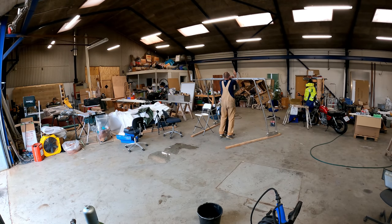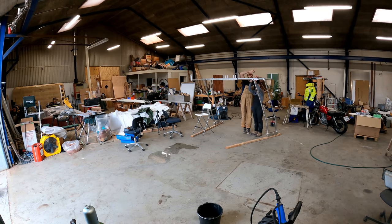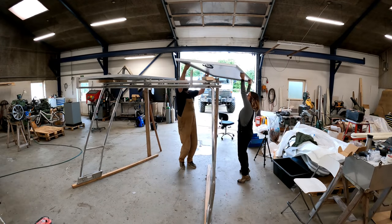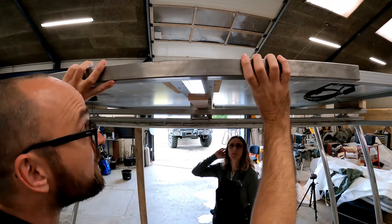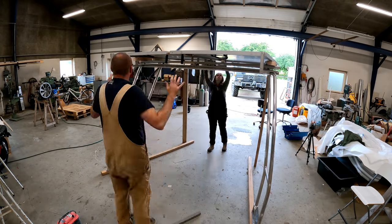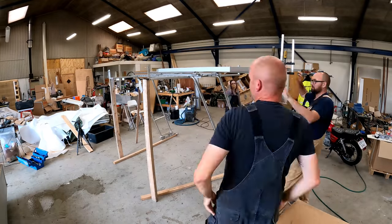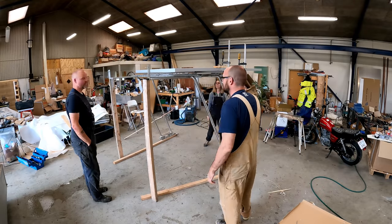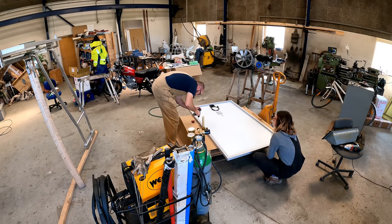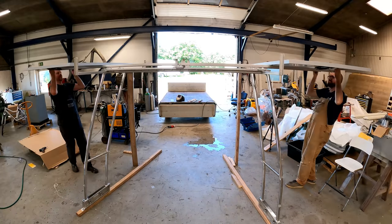At the workshop, Ava and I started by tightening the 86 nuts and bolts that secure the aluminum track for the sliding solar panels to the arch. We have thick UV-resistant plastic separating the aluminum from the stainless, and plastic washers separating the fasteners from the track. The solar panels are big and bulky but we managed to get the top two panels in place and lined them up perfectly using a bit of square tubing. The two panels were secured to each other with clamps and lined up on the arch before drilling any holes. The cement boat crew showed up just in time to help with the bottom panels — the ones that are going to slide. There were a few minor adjustments required, but then it was on to more hole drilling, and voilà — we now have sliding solar panels.